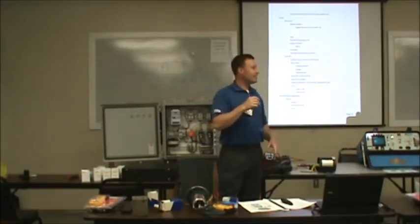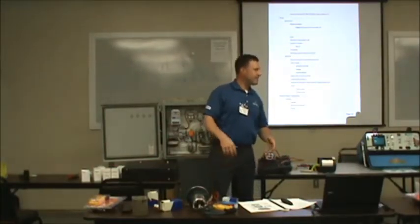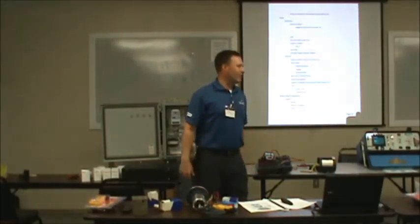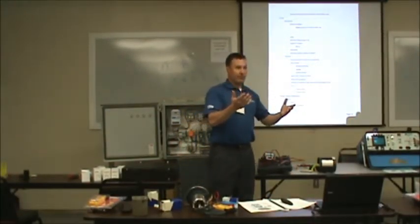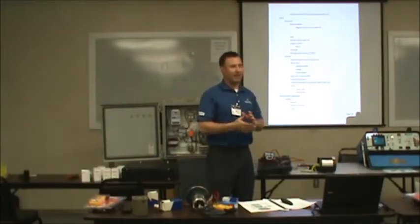We had a pump last year where the collar came loose from the shaft. Oh, I see that a lot. Shafts break off, impeller bolts come loose and fall off, and the pump's in there running. Rocks, too. If somebody's got an impeller on a pump, make sure you haven't got a concrete block in there, right, Greg?